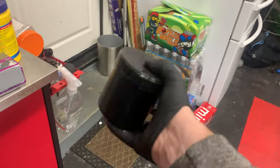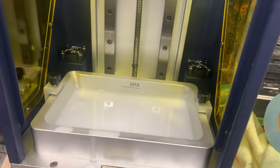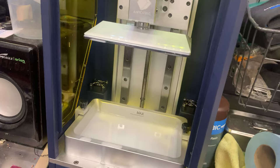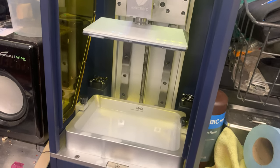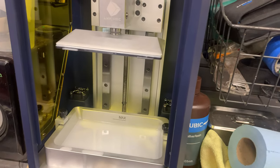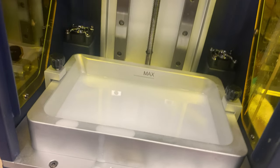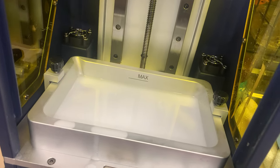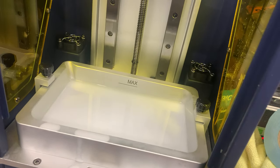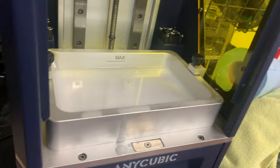I'm just going to shake it a little bit. Whenever you 3D print something, it comes out of this primordial goo and sticks to the bottom of that plate. That's how resin printing works as opposed to a regular 3D printer, which prints from the top and squirts out layers of molten plastic. The reason that a resin printer's resolution is so much better is because the layers can be so much thinner as a result of it being pulled out of this goo. Basically, there's a little monitor down there that exposes the resin, which is UV sensitive, and it cures the resin one tiny, fractional layer at a time as it pulls it up out of that resin bath.